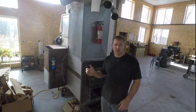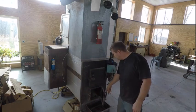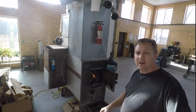I change the filters every month out here because it's real filthy. The book tells you twice a season. They're 16 by 20, one-inch filters is all you need. Sounds like it's getting going - let's open this up. Yeah, it's starting to go.